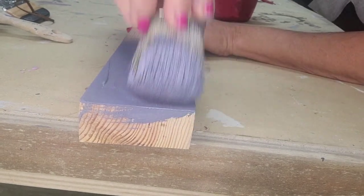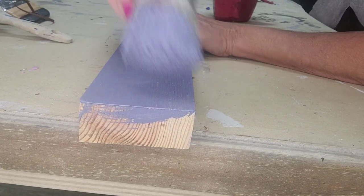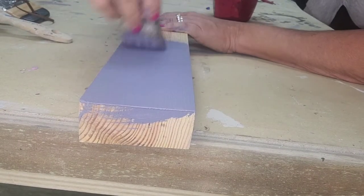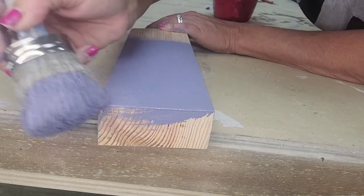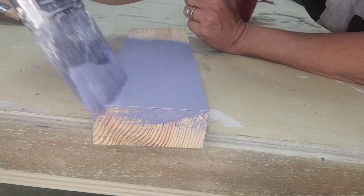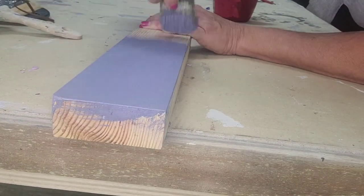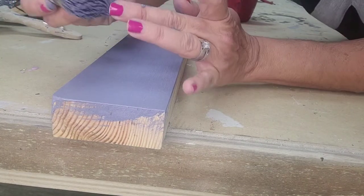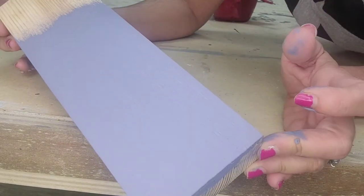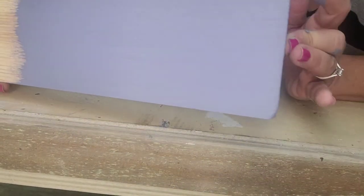I'll put the next coat on with the oval brush. You can also dab it into corners — versus the regular brush, you can't do that, especially in small tight corners. With this brush you can get into those corners and creases, which is great. With the regular brush it would be hard to get in there and it leaves a lot of paint. Again, really hardly any paint wasted here, it's basically already dry. There are no lines from the paint — only lines from the wood grain.